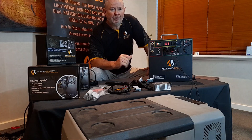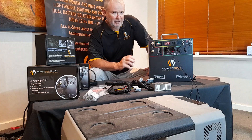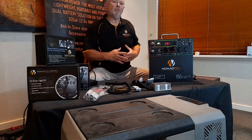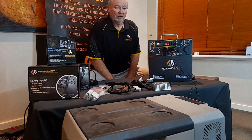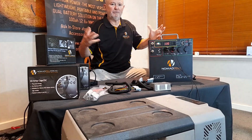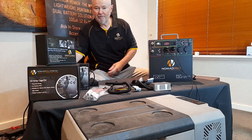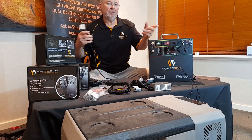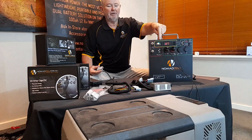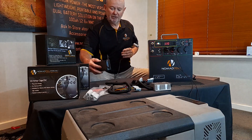Welcome back to Nomad PDU for a pre-Christmas refresher on a number of topics. The first one being charging the Nomad: when you're fully off-grid, when you're at home, and when you're on the go. The simplest way to charge is from the AC-DC. You can fully charge before you go out, get your fridge running, and draw down on the Nomad. The AC-DC charger that comes with it will charge the unit up to between 12.4 and 12.6. You can see the screen go higher than 12.6 sometimes, but it will still be 12.6 at the output — there can be a small calibration difference of around 0.03.